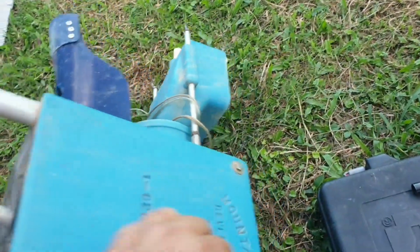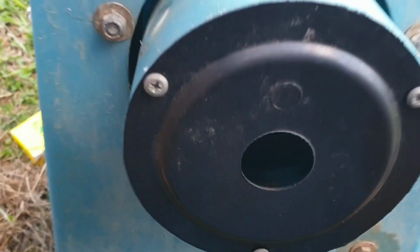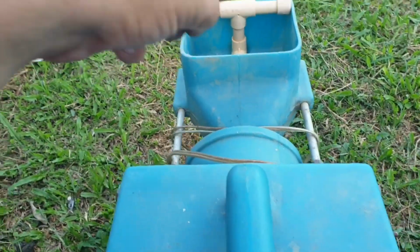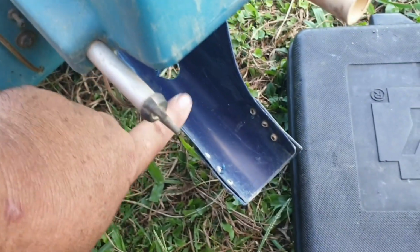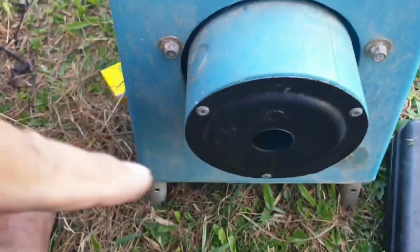Right, flip her over. Little toy. Well, here's my latest mod. If you can see in there, there's some gravel laying in the trommel, a bit of sand there. See it down there? The idea was to halve the volume coming out of the back of the trommel, so it can stay in there longer as it feeds in here and goes in here, hits the spiral, and the gold concentrate comes out here for collecting your gold, and the overburden or rubbish comes out the back.